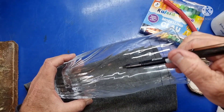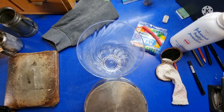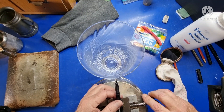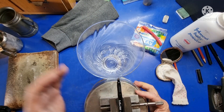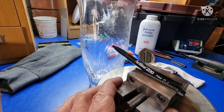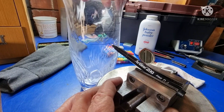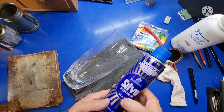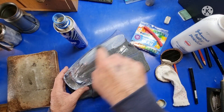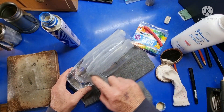Where an item is too high to make a suitable line, I use the vice trick — this saucepan just happened to be about the right height. Another great trick to get a high-definition layout is to rub silver polish over the job and let it dry. This looks similar to the plasticine and powder method.